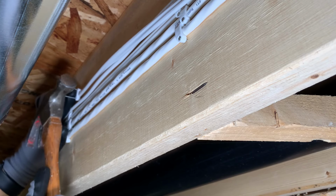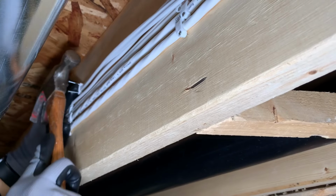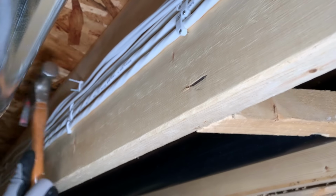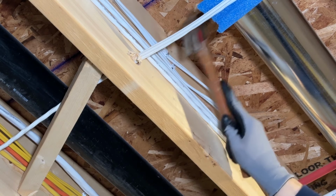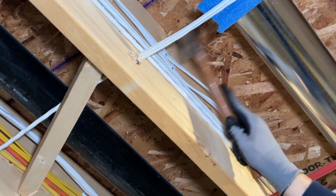I filmed myself using this side hammer technique in 2 spots recently. The first shows you how turning the hammer sideways actually gives you a fair bit of space to drive the staple in. Now, sorry about the shaking, the camera was attached to the joist. The second shows how it is not that hard to hammer the staple in all the way.